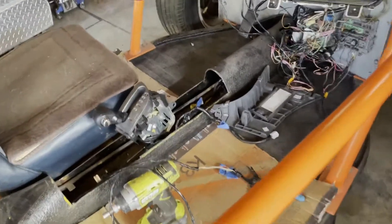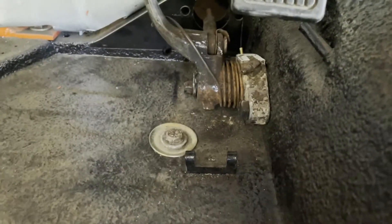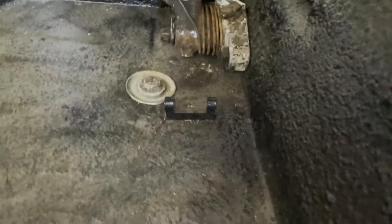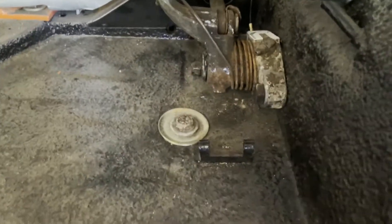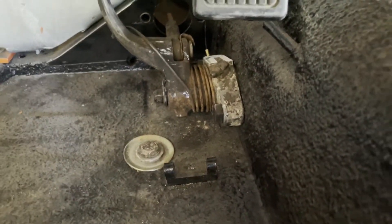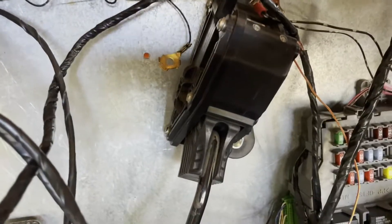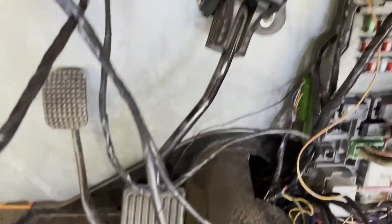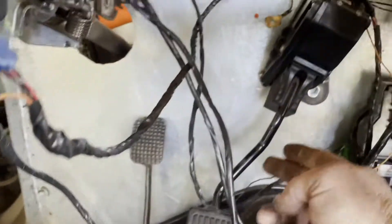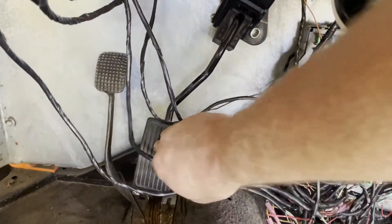We're back again. At this point we just reinstalled the brake pedal, tore the clutch pedal out of the system, and chopped off the gas pedal part of the original VW system. So the only thing down there now is the brake pedal attachment, bolted in finger-tight for positioning. We've pulled out the electric gas pedal from the Honda and have it up here with just a spring clip clamp, getting a general feel for placement. Had to bend the pedal bar a little because it stuck out way too far with a hard bend — the pedal sat out another two inches forward unnecessarily.